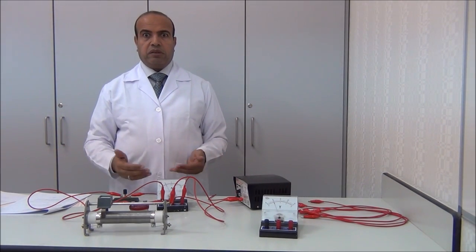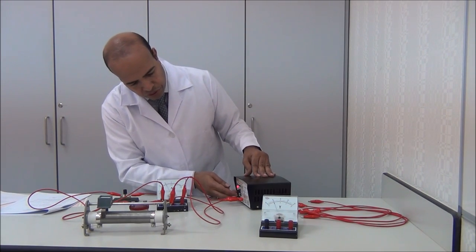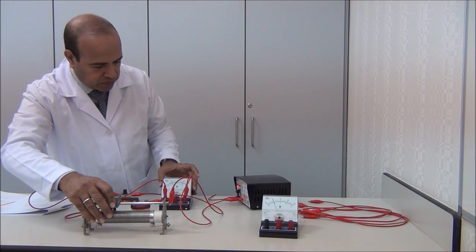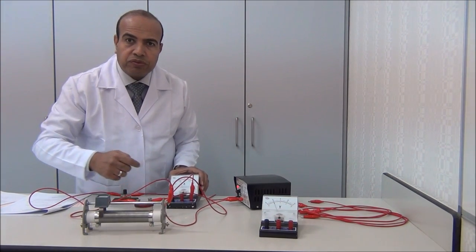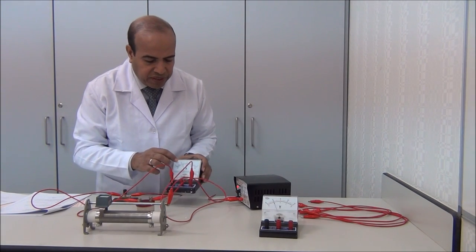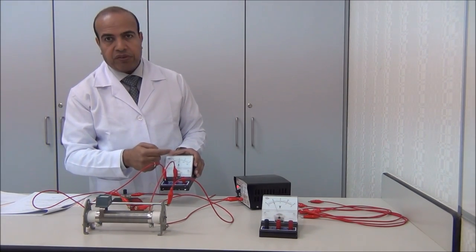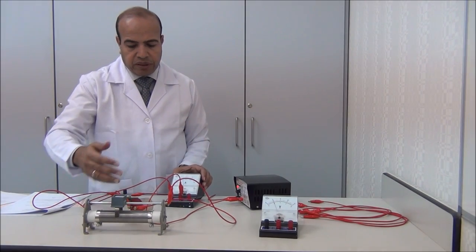Is it a closed circuit? Is it working? Now switch on — we switch on. You can check by moving the power supply dial. You can feel that the ammeter is working — the indicator of the ammeter moves, so it is working. Because the value is very small, we can change to the lower scale for a bigger reading. We remove the connection from the 3 A terminal and move it to the 1 A terminal — now it reads more clearly. When we move the rheostat, the ammeter indicator moves. The circuit is working perfectly.